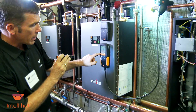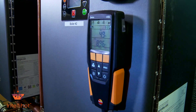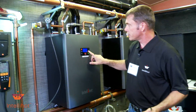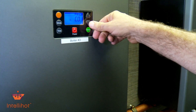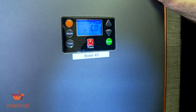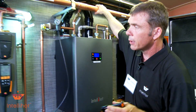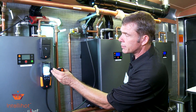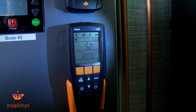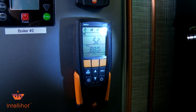It's been running now for a couple minutes. I'm at 8.96, so we're within that 8.8 to 9.1, so we should be good on the high fire. To check low fire, all you have to do is throttle up or down — now it's going to set itself in low fire. We know we're calling for our water gallons per minute, but we're just going to give this a couple minutes, and you'll see this adjust. If we're in our range, we don't have to make any adjustments. If we're not, we'll fine-tune that high or low fire with the little 2-millimeter Allen head screw port.